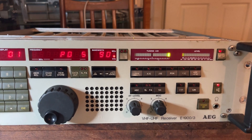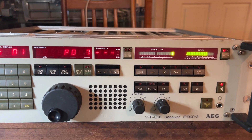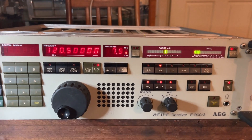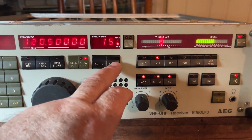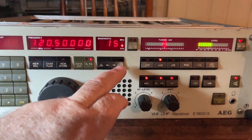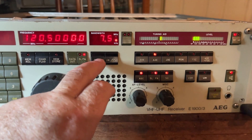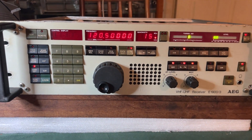In this particular unit there are five crystal filters and one wideband 2 MHz filter — and you can see that coming up there. We'll just clear that. The filters are simply selected by up or down, and you can go right up to the 2 MHz section. So that's the fundamental operation of the unit.